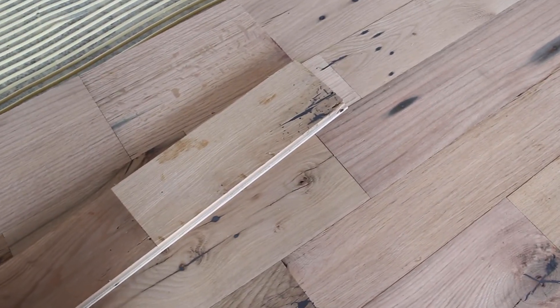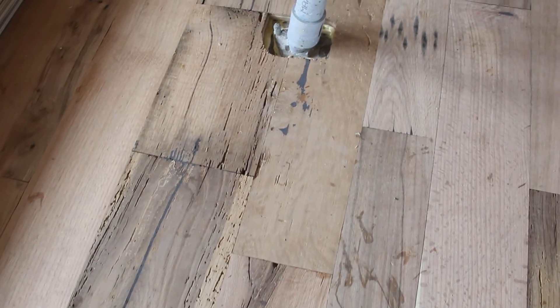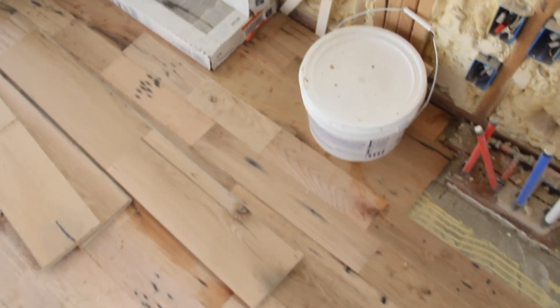This material is already defected and 100% usable, but sometimes you'll find character you don't want — like a board with a damaged corner or extra fill. Think about those boards as you go along and figure out where you'll have cabinets. We knew we were going to have cabinets in certain areas, so we put boards with more character or extra fill around those cabinet spots. We kept sorting that material aside as we went along, and near the dishwasher area we put material that wasn't quite as good.